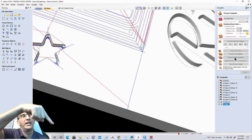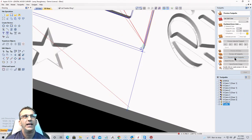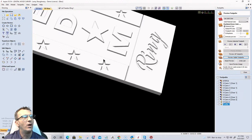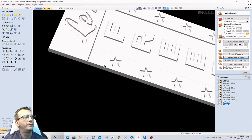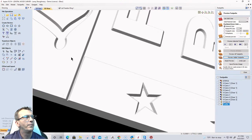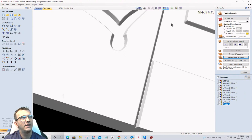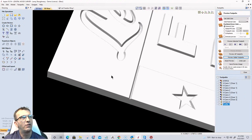But that bit is going to be cutting on the same side of the line as our rectangle cut, so it's going to cut on the inside line, and that's what I want. I want a nice, consistent line coming right straight across here. So there's not going to be an offset there. My apologies, I'm wrong on that one. I want no offset on that. If we go and look at the top, same thing on the top. I want a nice, consistent line running across there.